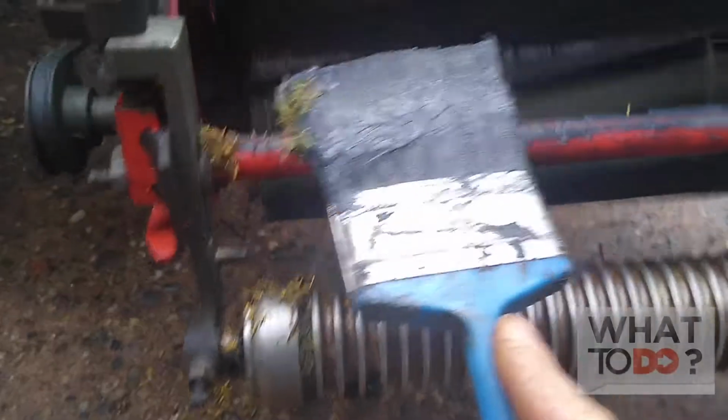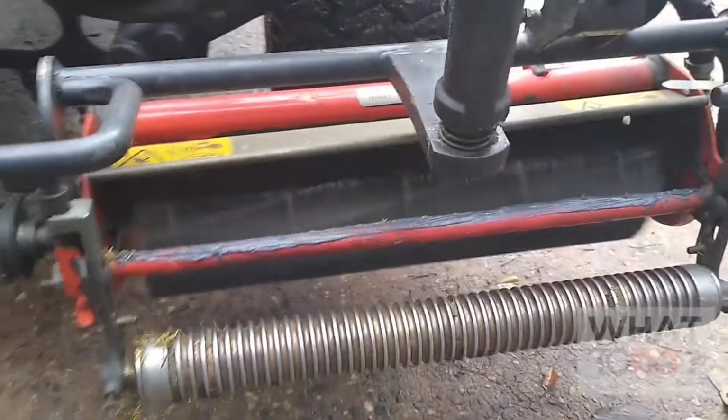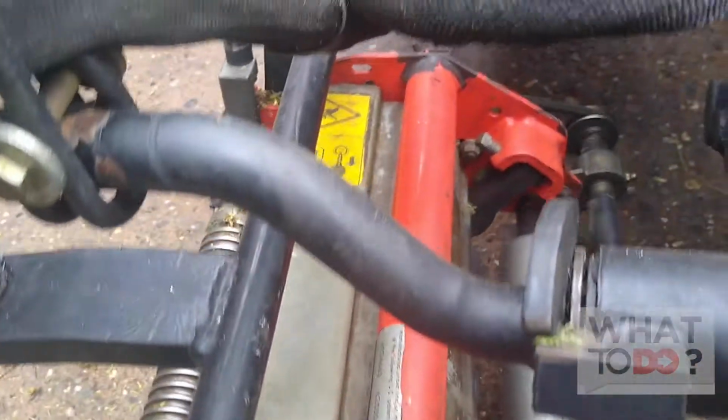Now you want to be very careful, because these blades are spinning at a much higher speed than your backlapping machine normally would. So you can adjust your throttle to get it to a comfortable speed that you need. This first reel here, I was putting some compound on it, and you should hear some type of friction, but I got nothing. All right, so that means we're going to have to shut that machine off and come back here and adjust these on each side.